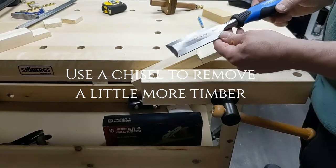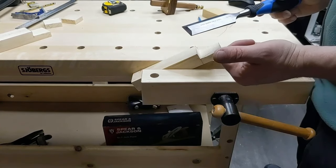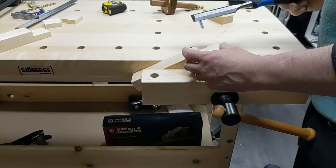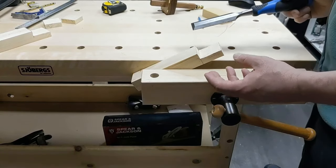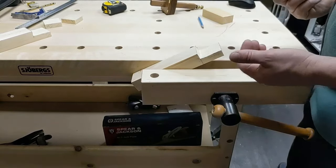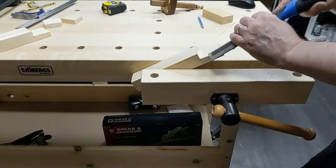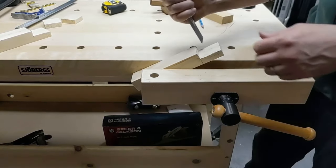I'm using an inexpensive chisel here - I've chosen one as wide as possible. When starting out we don't want to spend a whole lot of money. This came from a chisel set that's about £30. When you get into hand tools and want to spend more, you could use a specialist router plane which will get you a perfect finish - well, almost perfect, as good as you're able to use it. But when you're a complete beginner this is affordable and quite good. With practice you should get within about 1 mil of where you should be - that's a good tolerance. If you're within 5 mil, that's great, you just need a bit more practice.